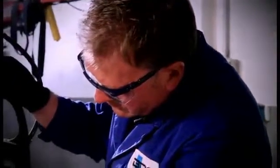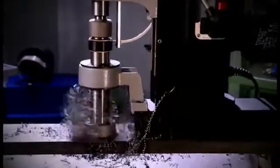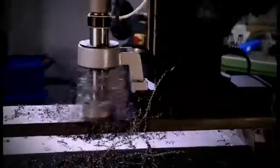In the case of greater material thickness, for example 50 mm and more, it is recommended to break the chip and to ventilate the tool at regular intervals. Always pay attention to proper chip removal and consistent lubrication and cooling. Nests of chips should be removed from the tool if necessary.